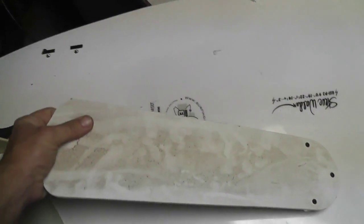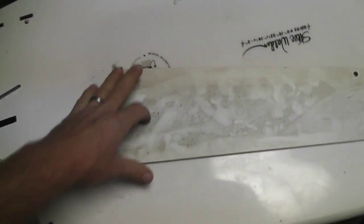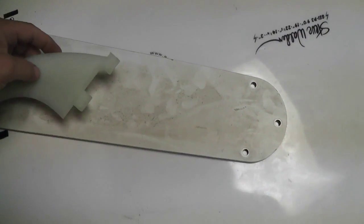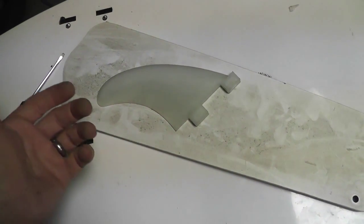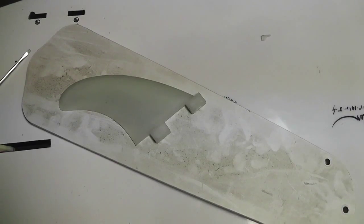That's just wood grain. This is, I'm sure, just MDF, like it's just glued together sawdust basically. So this would not be watertight at all, but if I coat it in some epoxy, which I should be able to do, then we should be good. So what I'm gonna do is trace this guy on there, and then I will just hit it with the belt sander to shape it, and then coat it in some epoxy, and we'll find out if it works. So you can follow along.